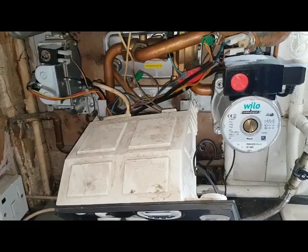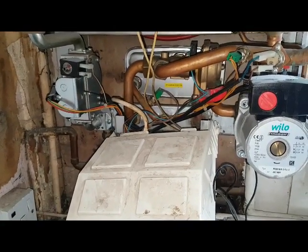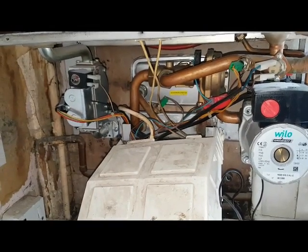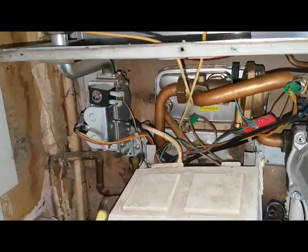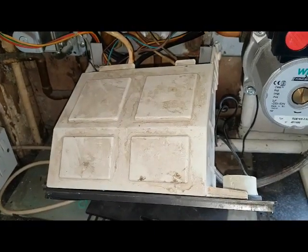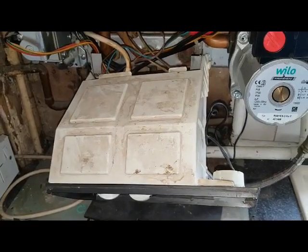Pete wants to ask a question. In the Mark 1 version you mentioned a control box and a second PCB — is the second PCB the control box? Yes, on version 1 the control box would be on the side of the gas valve, dealing with the ignition spark, gas valve, fan, and the driver board located in here — so that gives you your two PCBs on version 1. On this Mark 2 you've got just one board inside here that does everything.